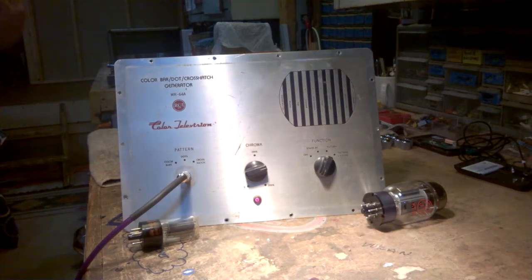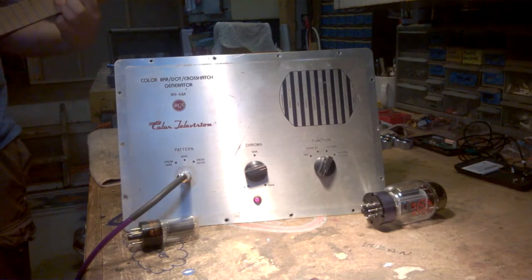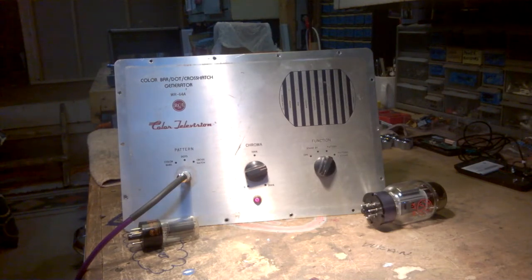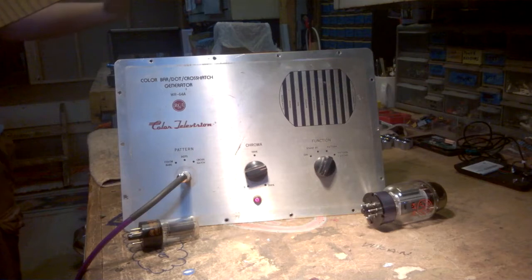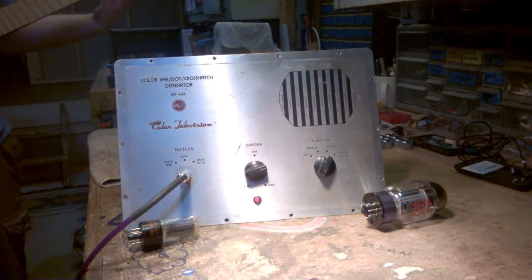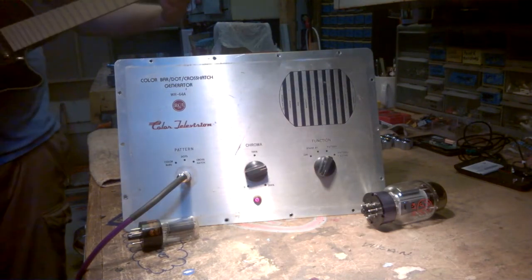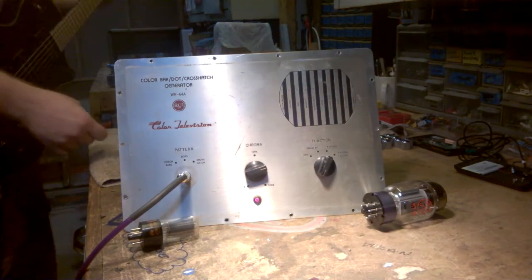Personally I like it, but my opinion is irrelevant. The more negative feedback you introduce in your signal, the more controlled and less raw it will feel — your gain will be reduced and the speaker will seem to interact less with the rest of the amp. The less negative feedback you have, the more open and roomy it's going to seem.